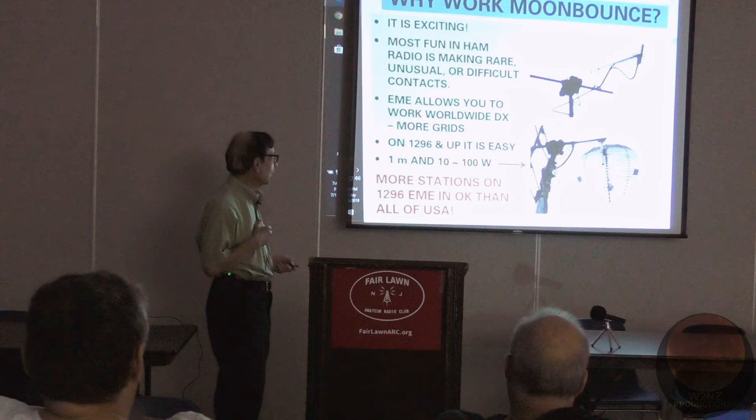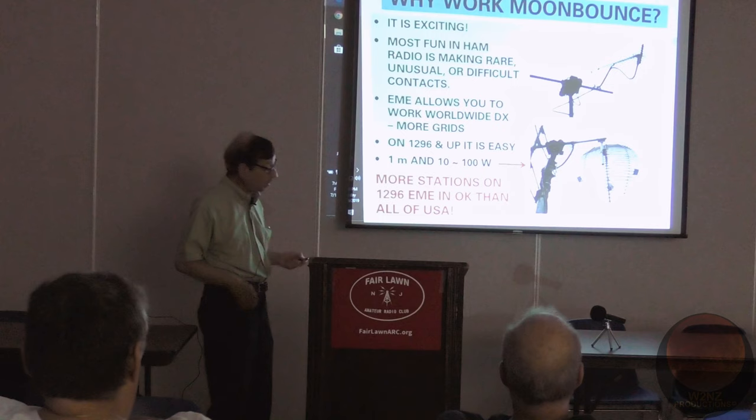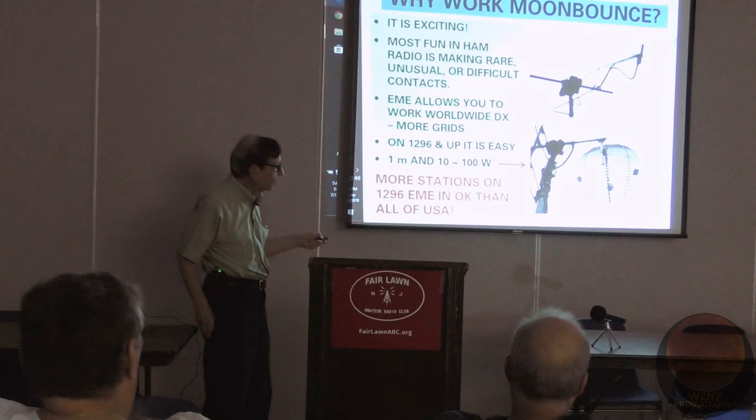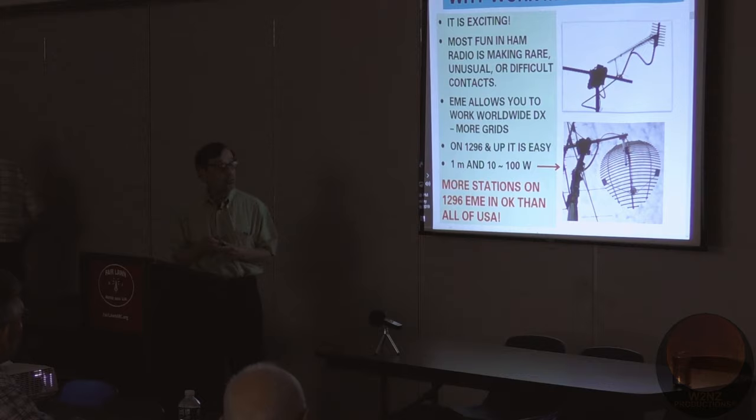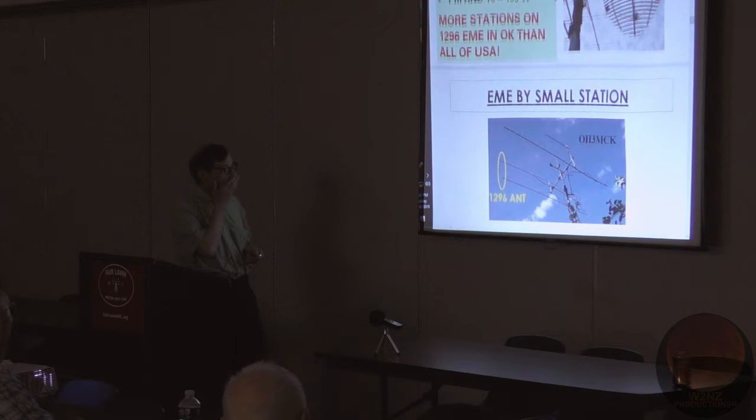And as I say, it's easy. I show you, these are antennas that people I've worked and who are active off the moon. Here's a single Yagi. Here's a small TV dish. You know the fellow who does this, a younger fellow, who's made contacts with that TV antenna on 1296 EME. So you don't have to have a huge antenna to do this. And if we can go on, I show some other examples here.